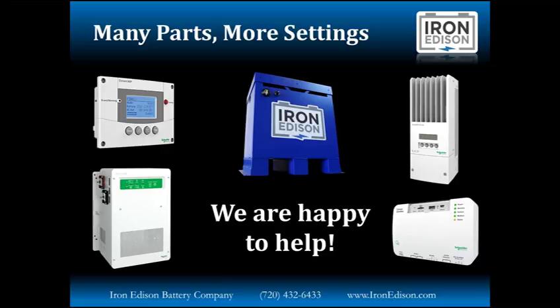To make it a little bit easier, you can have a router of some type, like a Linksys or a D-Link router. You don't necessarily need internet connectivity to do that. If you can get a network connection between whatever device you have and the CommBox, you have full access and control of the system locally without using the internet at all.